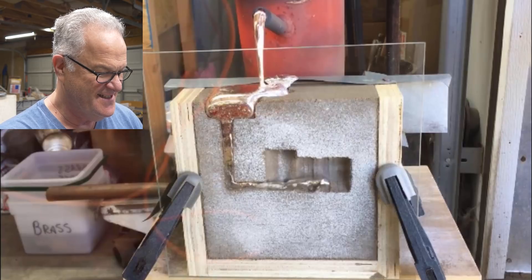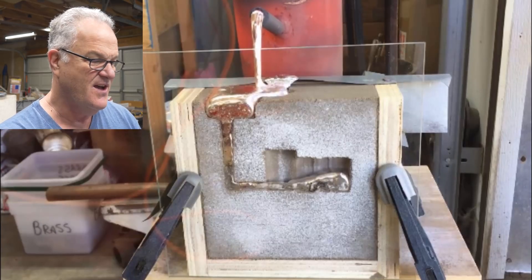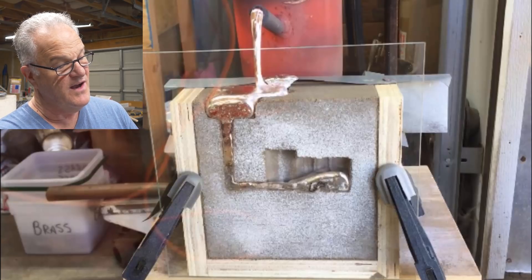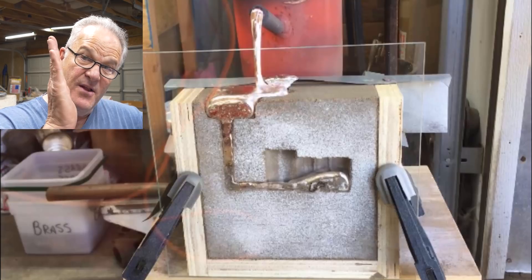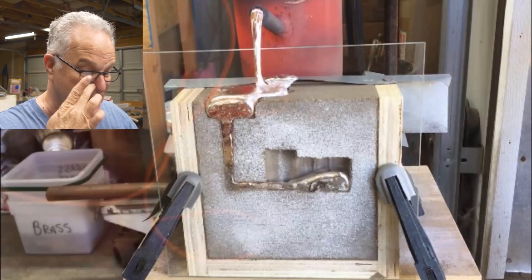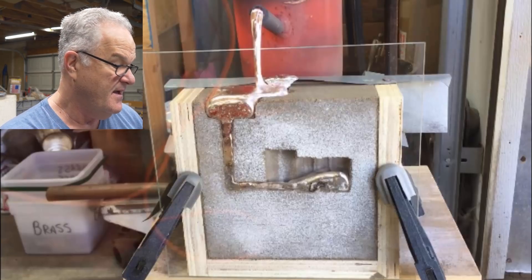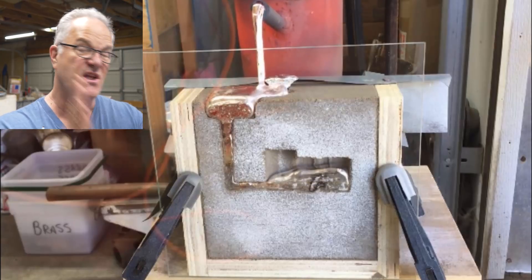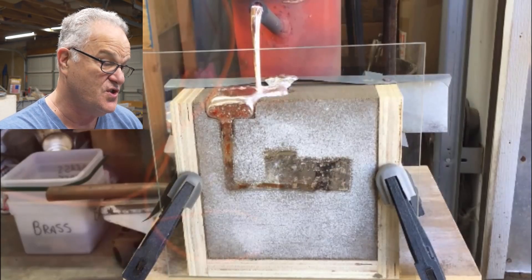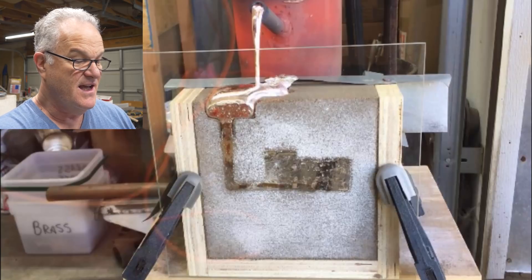Let me show you what happens next. You see what happens: the metal has come across, it's hit the back wall. And look at what we've got — a buildup of metal at the back. That metal has hit and it's started to come back on itself. It's built this reflective wave that's going to happen, and you can start to see it there. The wave has hit the back wall and it's getting ready to come back on itself. You see the way it's filling backwards, coming back over the top. That is the reflection off this surge that we're going to try to deal with using the surge trap.